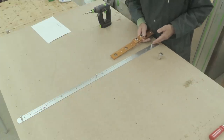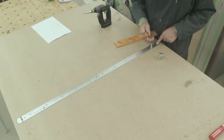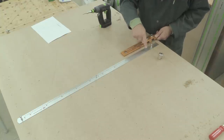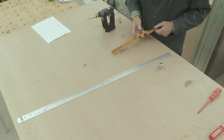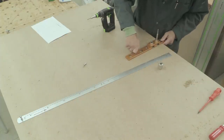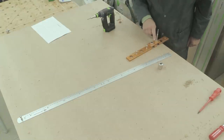Before I go any further, let me just take you through how we're going to enlarge this 3mm hole to turn it into a 20mm hole. We're going to use this drill guide. In order to set this drill guide up, we must have, because it's going to be at the end here, the 20mm cutter will be coming through here, we must have pinholes here and here. So in other words, those two must be pinholes so that this can be set in place and that hole drilled. Now, I think if I were to now put this 20mm cutter in here, I'm not going to drill this hole, but that's there ready to go, and in would go a 3mm pin there and there, and then that block is now nicely set up so I can now drill that hole.